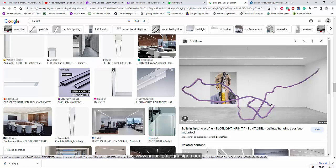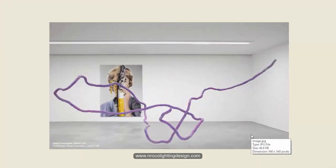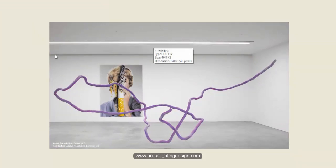I told him it's a slot light — a linear fitting LED luminaire and really good for wall washing. If you want to use this in your design, it's very easy and very effective for wall washing. I'll create a small simulation showing this fitting. I'm not promoting it, just showing that it's really effective. We'll run a calculation so you can appreciate the light. Other brands may also have slim linear wall washers. The most important thing is the offset of the linear fitting from the wall.